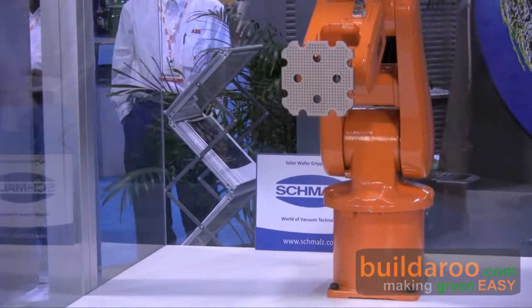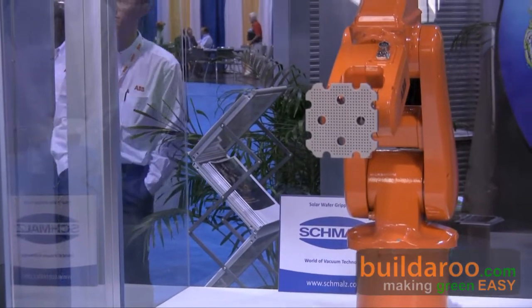Can you tell us about some of the robot's characteristics? This robot is equipped with a four-kilogram load capacity. In certain cases, when you tilt the wrist down, we can handle six-kilogram load capacity. It does have the quickest and most accurate path accuracy on the marketplace, and it is accurate within .01 millimeters.